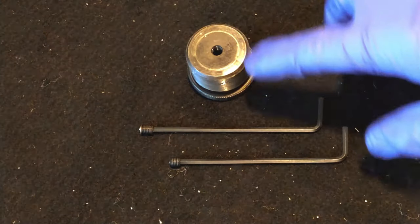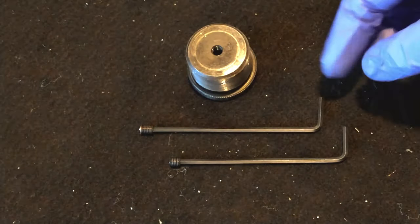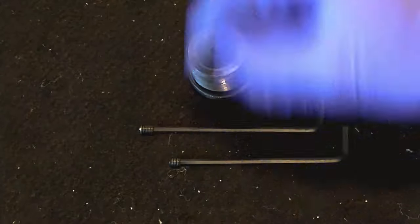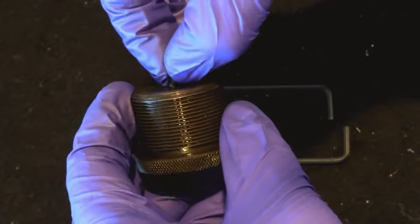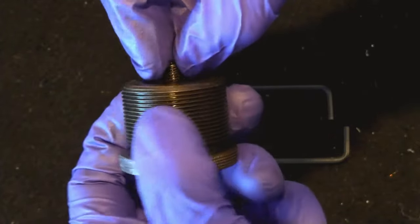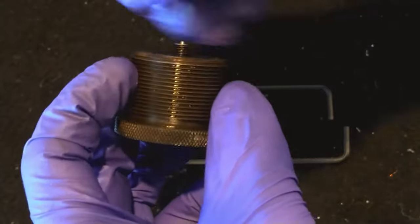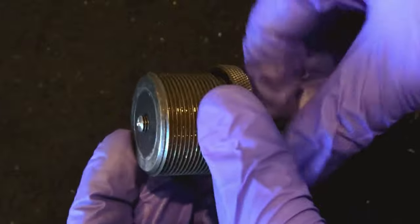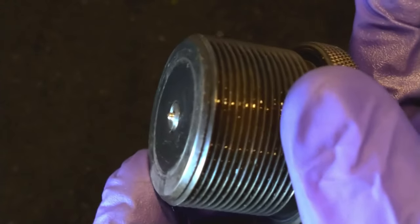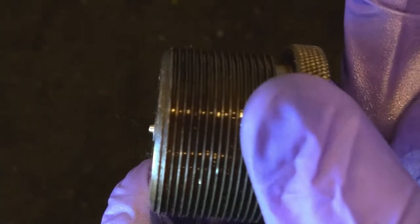The firing pin and the little piece behind it are just set screws. I assume Cobre just milled down part of a set screw for the firing pin. Now I'll show you how to assemble all of this. This is the breech with the fixed firing pin. I'm going to show you how the firing pin and the locking set screw work. I'll take the firing pin and just start it — she's started. I'm going to reach back in with the number three metric and screw it back to right about there.